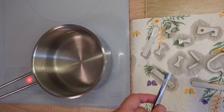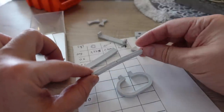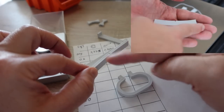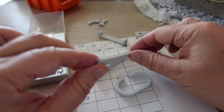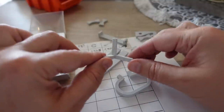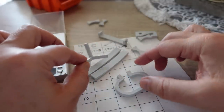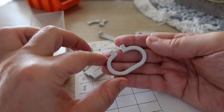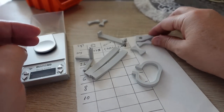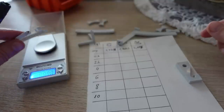I will leave them 5 minutes on a paper towel and measure the weight of those 3 objects. The impact test object deformed in an interesting direction - along the Z-axis, similar to the heated bed result. The bending test object has some stomach shape - it already bent. The shrinking test object shows very similar deformation to what we saw with the heated bed annealing. The creep test object I will measure the weight for, but I will not do the creep test because the deformation is too big. Other test objects are in quite good shape, and the markings survived.